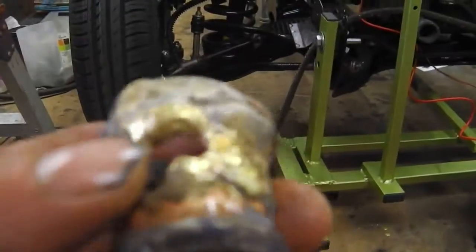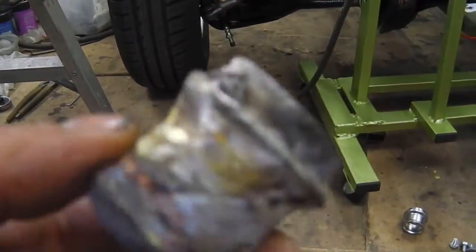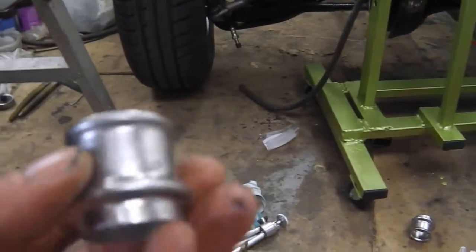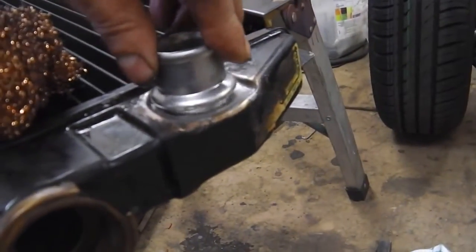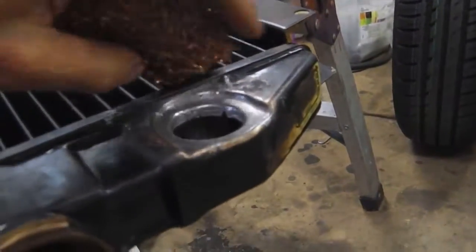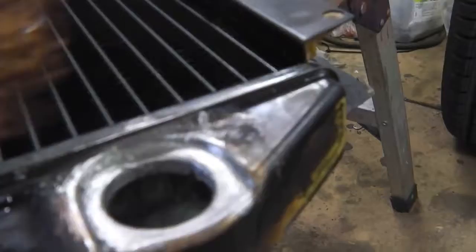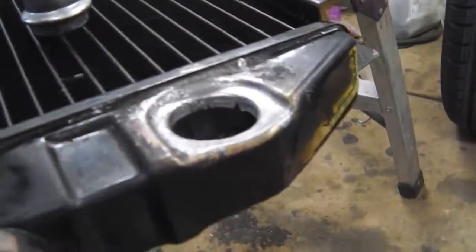As you saw just earlier on in the clip, but no, not happening. Don't try and braze these because it won't do. It blows through. I'll be there all day. Chuck it away and buy some nice proper front entry fittings. So I'm going to flow solder these in nice and clean, and it's got to be really clean.